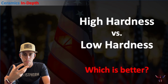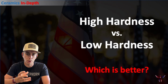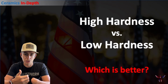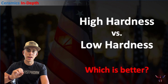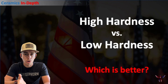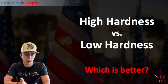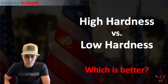Think like a diamond, right? A lot of people say, hey, you can't scratch a diamond just because of how hard it is. That's the approach we take. Now, some people will go the other route and pick something softer, with the idea being that rather than being very hard and scratch resistant, we just won't take the scratch, but we'll catch that material and deflect it, and then get our longevity out of the coating that way. So again, there's no real answer that one's better than the other. It just depends on the application and what you're doing. I don't deal with the softer materials, and people that sell the softer materials don't deal with the harder materials. So it really just depends.